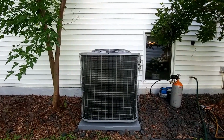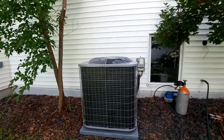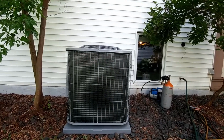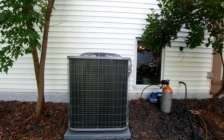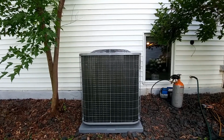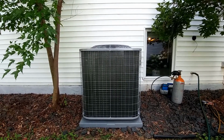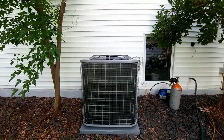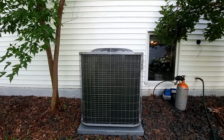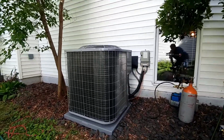Alright, this is one of those R4A 5 units, 15 SEER. I doubt we'll get 15 SEER because we couldn't rate it with our Goodman furnace in there, but yeah, due to that compressor shortage, this is what we got available in a 3-ton. Couldn't even get a 3.5 ton. The other day we ended up selling that C series unit, but this looks good. Just pretty much the same unit, but the screen around it isn't as beefy as our normal N4A, and certainly not like the hail guard on the C4A, which is a discontinued model, but we got one of them the other day. It was on closeout.